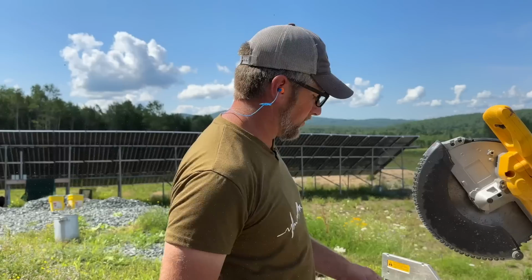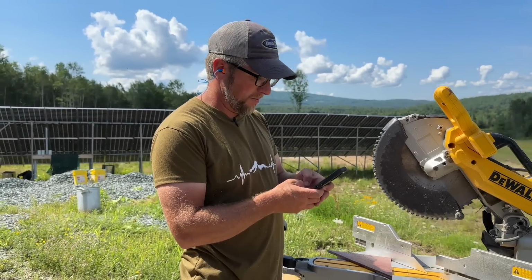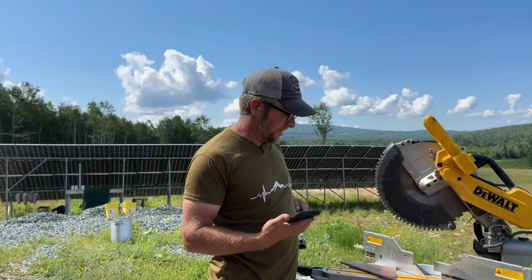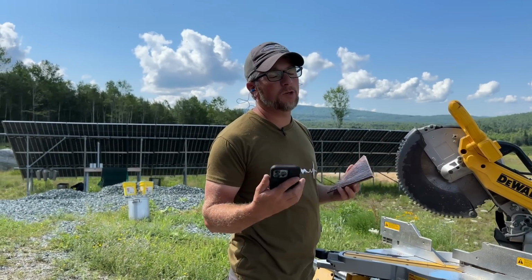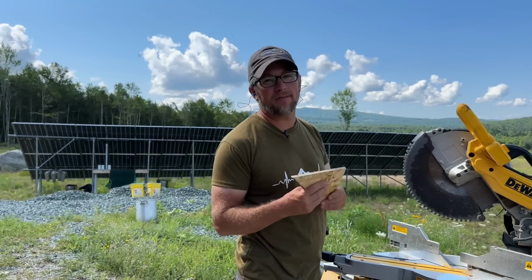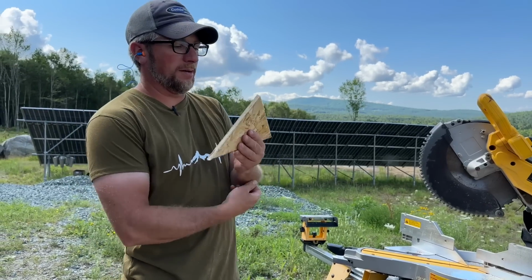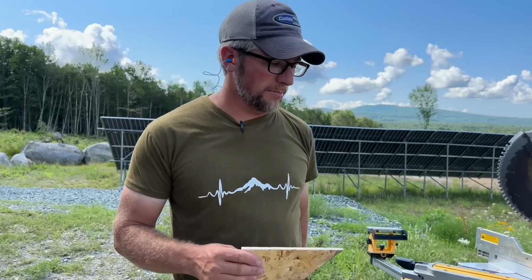Then I guess there'd realistically be one more little sliver. So go minus 8.35. I think that's gonna be it, because the next little sliver would be 2¾ inches. It's not even worth it. I'm not holding my fingers for that. You'll never see it. That'll be it. I get it painted up, and then I'll bring up the little brad nail gun to nail that in place.